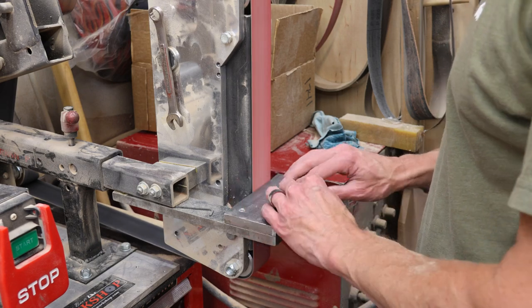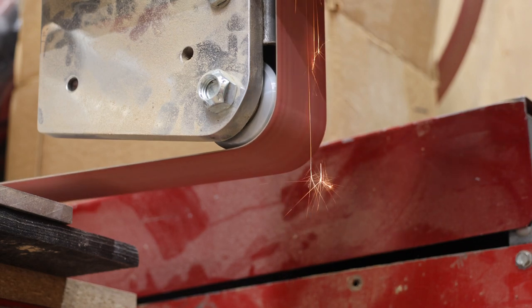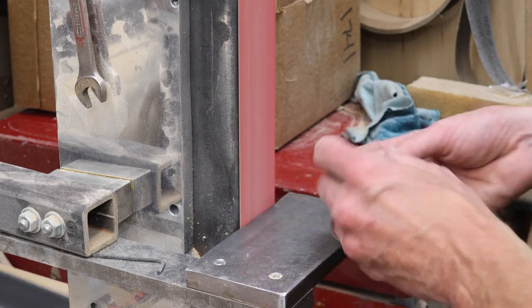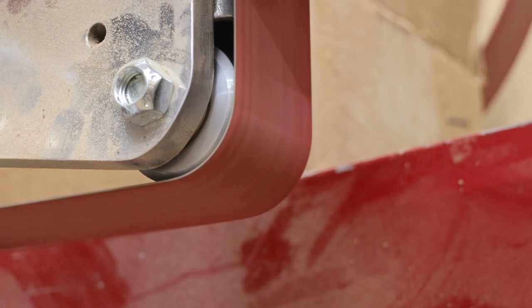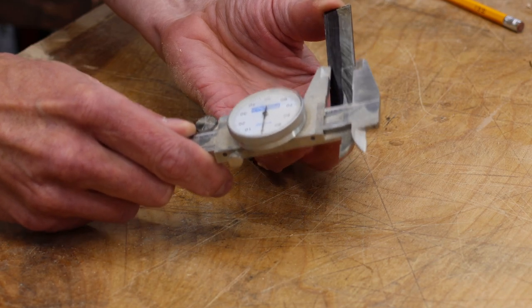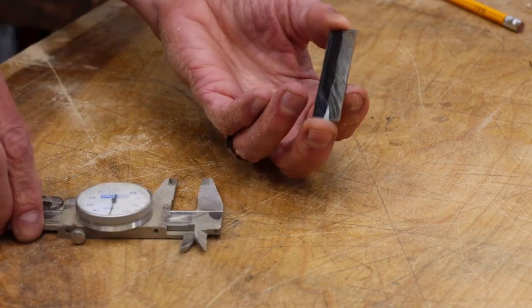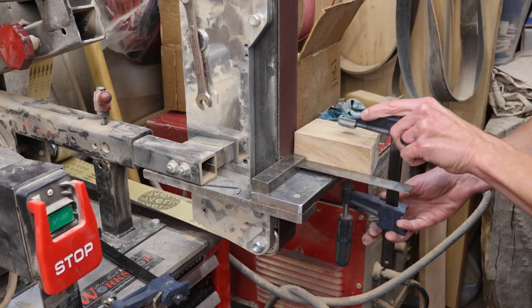With these irons cut down to their rough size, I'll head over to the belt grinder to square up the ends and get them exactly down to half inch wide. The sparks coming off the grinder are kind of star-shaped, which tells me this is in fact a high carbon steel — feel free to correct me on that in the comments. Once I get close to my half-inch width, I'll add some sharpie to the iron and use my calipers to lightly mark a line where I need to remove material. To help keep the edges square, I'm clamping a block of wood at 90 degrees to the belt as a guide.